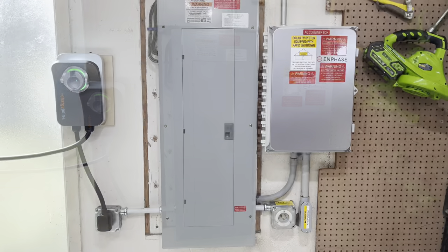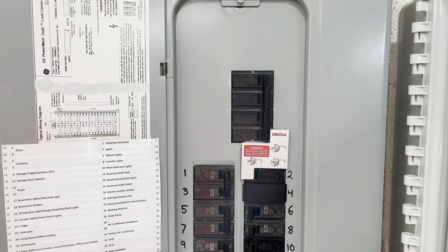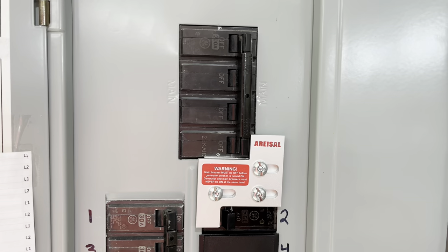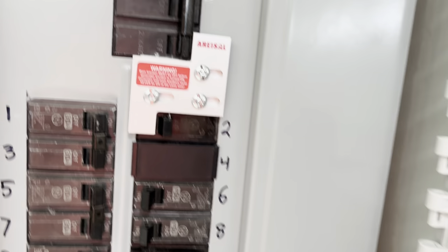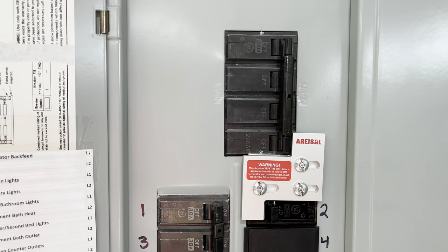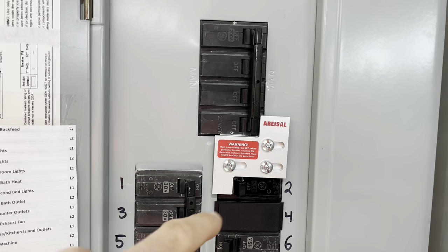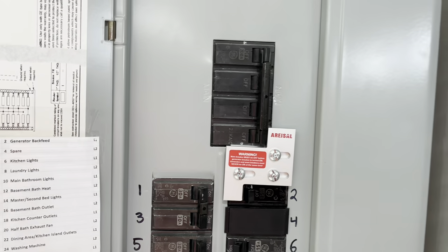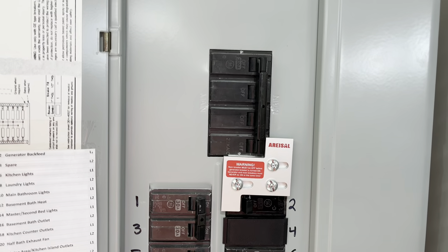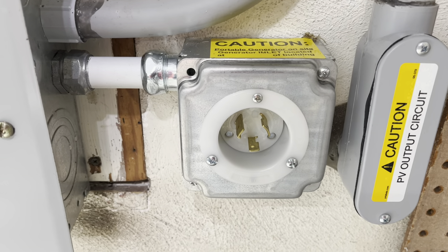It'll be nice to have in case of an emergency. So let's go over the prerequisite electrical requirements. This is my 200-amp GE electrical panel, and what I've installed up here is known as an interlock. It prevents power from coming in from the car, going back through the breaker feeding the panel, and feeding back out to the power lines where a linesman might be doing repairs. People with generators sometimes don't have an interlock and may forget to kill the main breaker — that could allow 110 volts to reach a transformer and get stepped up to 15,000–25,000 volts, which could kill a linesman. This is a critical piece of the system. Do not attempt this without an interlock.